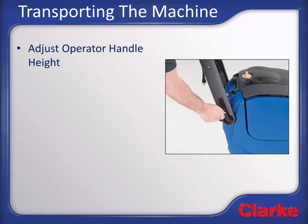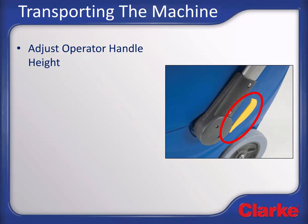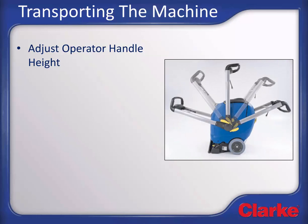Adjust the operator handle to a comfortable operating height. For the 16ST model, this is done by disengaging the handle level release levers and then locking them down at the desired handle height. For the 18LX, there is a single yellow handle on the left side of the machine that, when disengaged, allows the handle height to be adjusted. The 18LX model also has the flipped handle feature that, when extracting, allows the handle to be flipped over the top of the machine to the other side, allowing the operator to walk behind the machine rather than in front of the machine like the 16ST and other typical extractors.